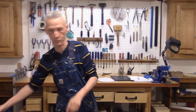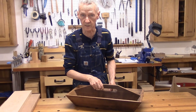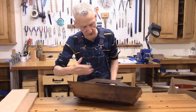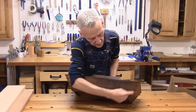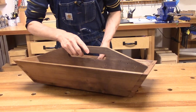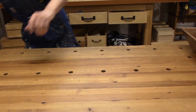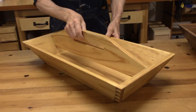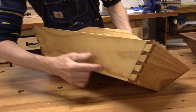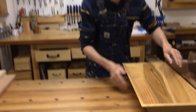Let's have a quick look at the first one I made — this one right here. It's American chestnut from a reclaimed barn board, really nice. It's got splayed sides and a compound dovetail angle joinery, very difficult to do, and it turned out really really nice. Here's another one I made identical to it out of pine, and you can really see the dovetails here. It was a lot of work.